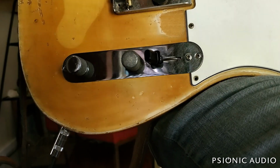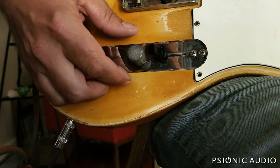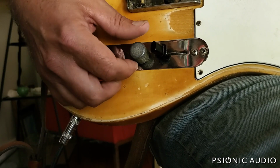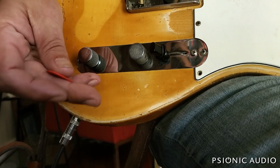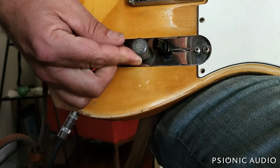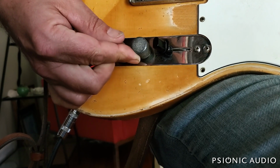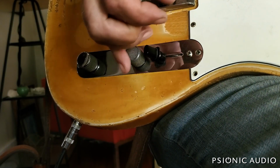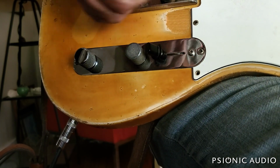This is that 68 Tele, and it's got a new volume pot and a tone pot. The stock 250K volume pot started off life as a 10% audio taper, and it had changed to the point where it was about a 2 or 3% audio taper pot. And all the volume change was in this last little bit, right here to here. A huge drop in volume here. And that was not useful, and it was very loose mechanically. So if you're changing the pickup knobs, half the time you would bump that volume, and then it would go down, that little change, you lose all your output level.